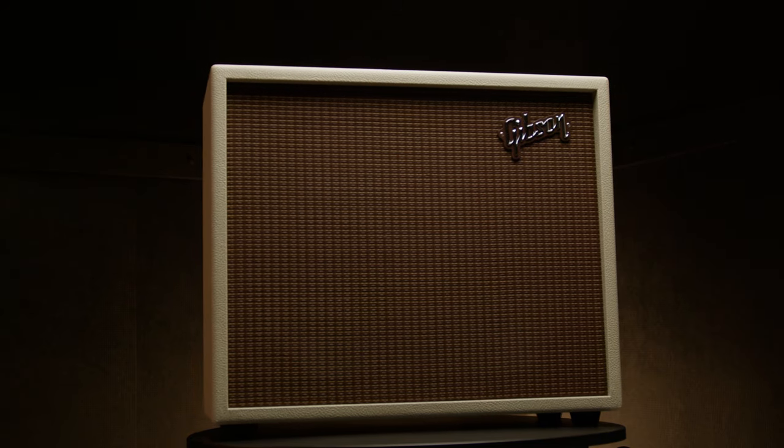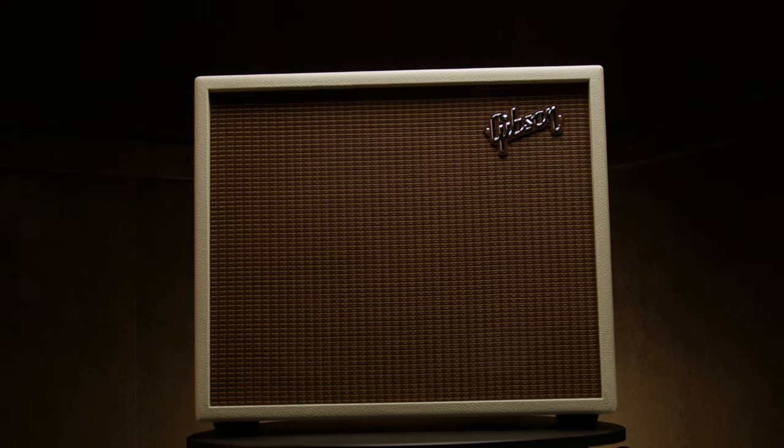Dual Falcon 20 has channel cloning, which is two identical foot switchable channels, each with their own multi-watt power scaling control, so you can set up your two favorite sounds and get the perfect balance between them. The amp comes stock with two 6L6 power tubes, but you can swap them for 6V6 power tubes without any mods or rebiasing. Now with 6L6 tubes, the three power rating settings are 15, 6, and 2 watts, and with 6V6s, it's 12, 5, and 1 watt.